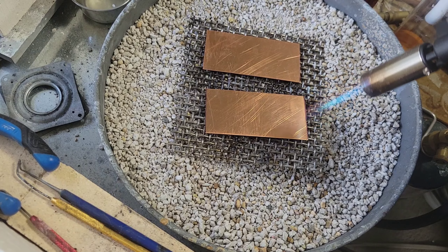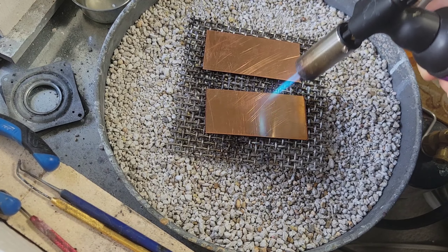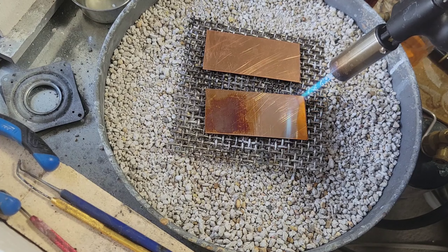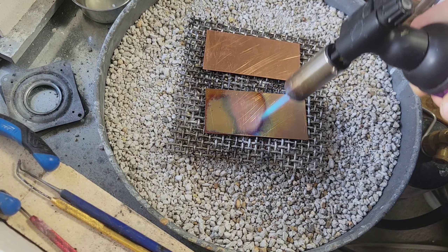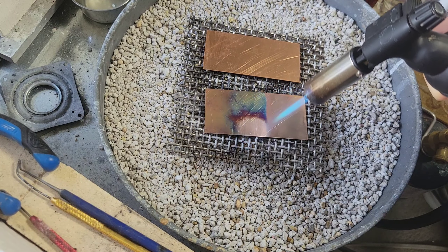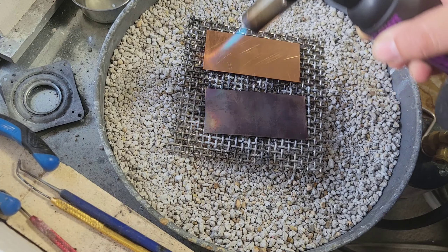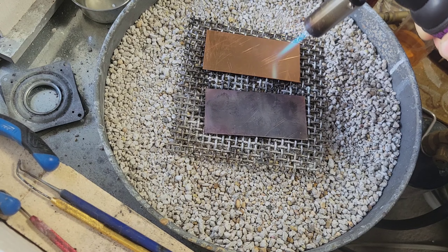To be able to emboss them, what we need to do right here is anneal the copper, so that it's soft and malleable — otherwise it's a bit hard on the machines, which are hand crank machines. So we're just going to get it to just before cherry hot. I love the color play that happens with heating these up — they'll get to a nice dark brown, just prior to the flame turning green as it hits it. And there you go, immediate dark brown. It's lovely.